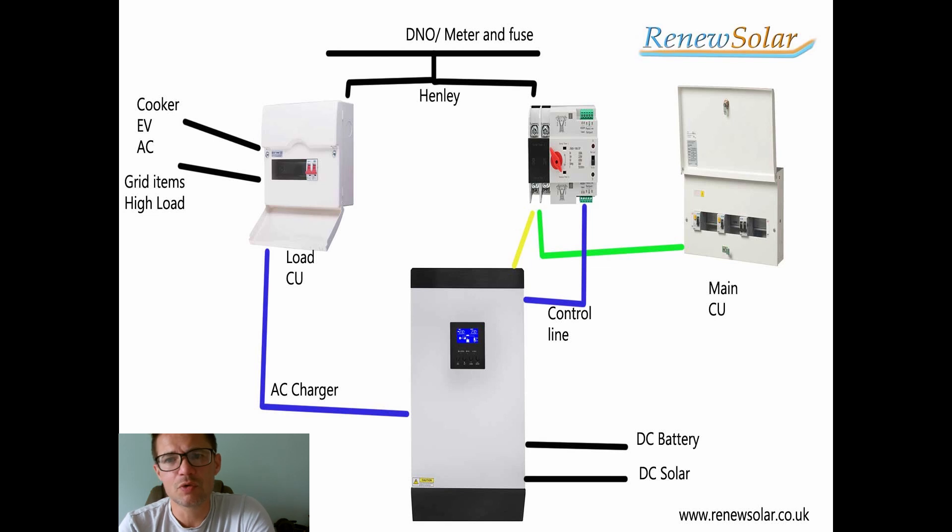Nothing really changes — it's a very simple system and it's kind of what's inside a hybrid system anyway. If you can get a 400 pound inverter and a 60 pound ATS switch, that's 460 pounds, which doesn't quite come to the 1200 pounds. When manufacturers combine these units there is a premium price, and it is more convenient, but it is a single point of failure. However, you can parallel the inverters and just connect them into the ATS.